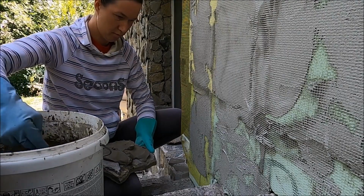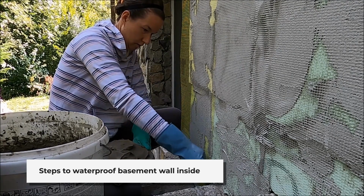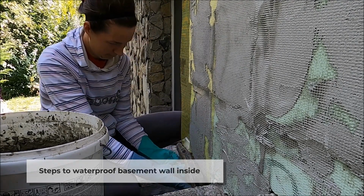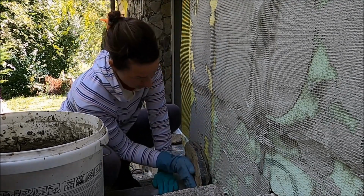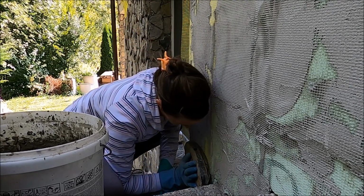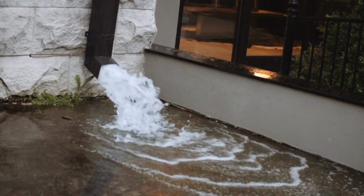How do you waterproof a basement wall from the inside? Prep the wall of old paint, wash dirt and dust off the wall, plug holes and cracks with hydraulic cement, seal openings in doors, windows, and window wells using waterproof caulk. Apply a coat of waterproof masonry cement to your wall. Install a sump pump. Use a quality dehumidifier. Vent dryer outside. Cover H2O pipes.